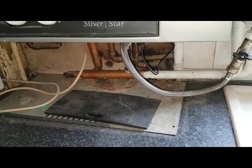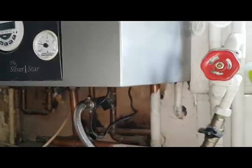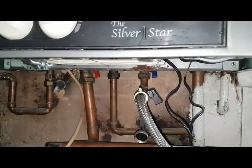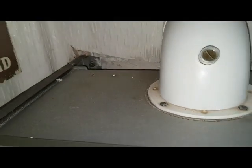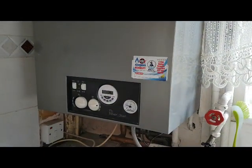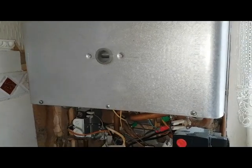At the moment the bottom panel is already removed. Normally we would have four screws on the underside — two on this side and two on the other side — and then that bottom panel will come off. Then you've got screws at the back and top, and then the whole thing just lifts off. We're now going to remove the combustion cover. You can see the screws there and there; remove them and it'll simply slide off through those grooves.